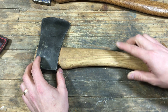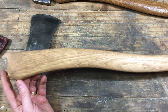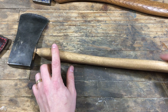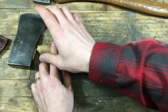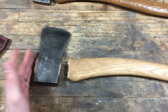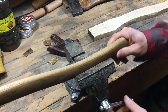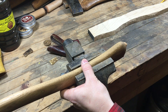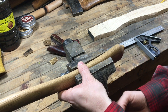I have eight feet of this board, two inches thick — I can make multiple handles and intend to for a number of other heads. But if the wood is bad like this, I don't want to spend the effort. I have this handle I can test, and the other half of the board that was previously shaped. I especially want to break the top where this broke and see how deep the porous material goes. The end of the board was where the top part was, so if there was rot coming into the wood it would start there. Let's do two-inch increments and see how far the rot goes.